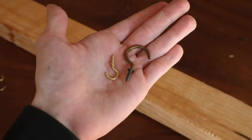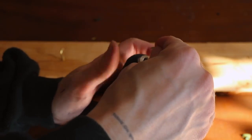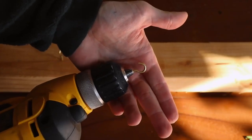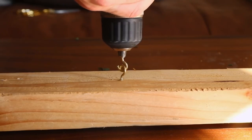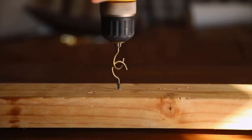This is a tool hack, home hack, and DIY hack for any screw hook you need to add virtually anywhere. I have a hard time when screw hooks are smaller or really thick — screwing them into wood or the ceiling to hang a planter. A great way to do it: get it started by screwing it in with your fingers, then take a second screw hook and install it into your drill as if it's a drill bit (screw side into the drill, tighten it up), then hook that hook through your other hook and turn the drill on. They connect and wind up together, screwing in your screw hook — really nice and convenient if you need to screw in a bunch of hooks.